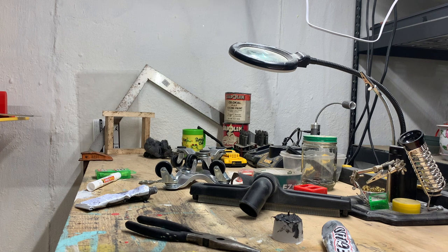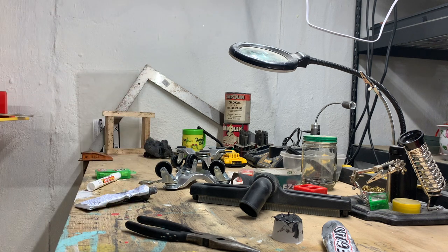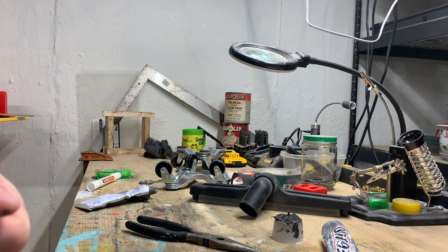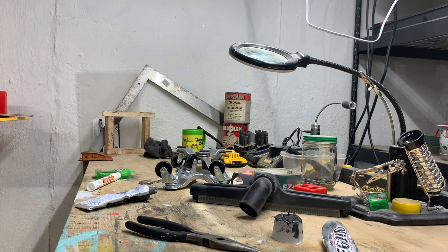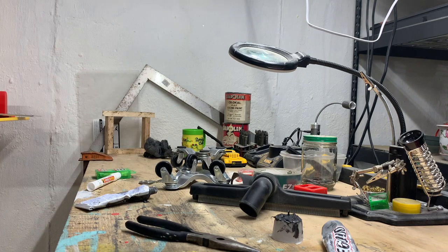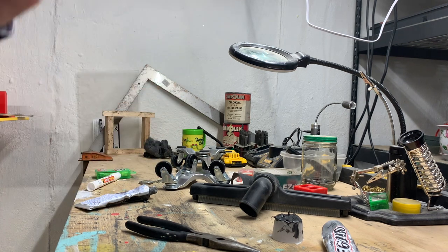A lot of times people will use RTV silicone to seal an oil pan or a water pump or what have you. They apply a lot of it and they just squish it all together. What happens is the stuff doesn't always cure completely, and it gets mobilized when the oil or coolant starts flowing and it starts to clog things up. A lot of times when you tear down an engine that has failed after a rebuild or after repair work was done, you're going to find a lot of this stuff in the oil pickup screen. You'll find it in the cooling passages, in the radiator.